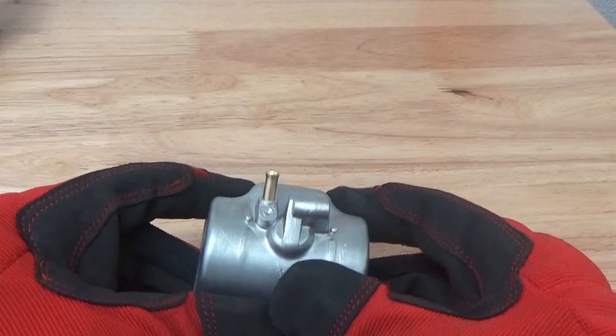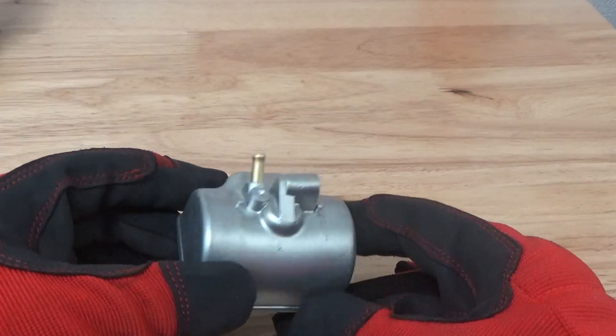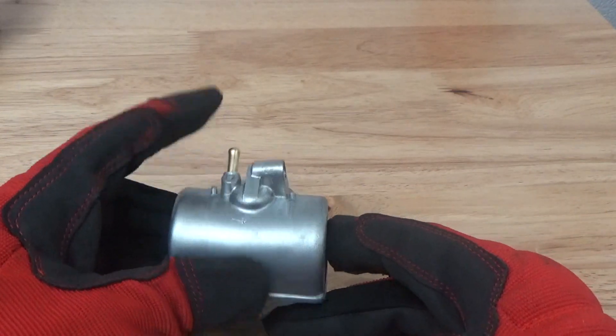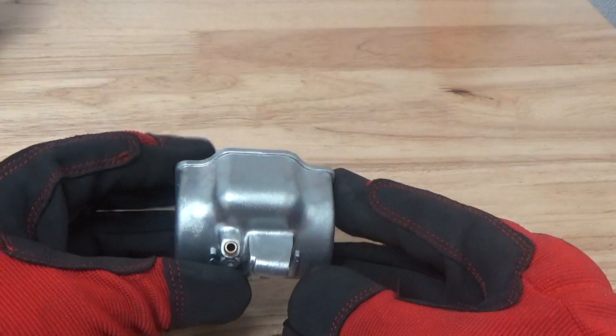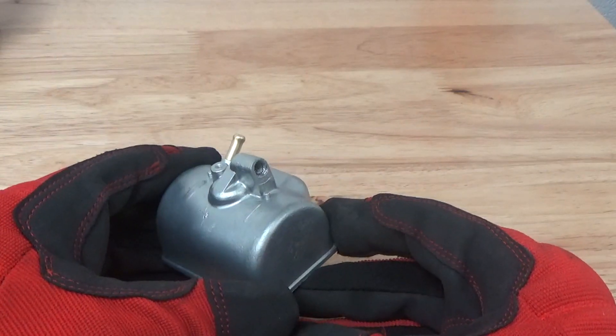You can imagine how much longer the ceramic bead lasts compared to glass bead. And you can get the ceramic bead in the same size in the very fine mesh range that we use. So again, you can get the same great results, have a lot longer abrasive life, and just a little bit quicker, faster clean.